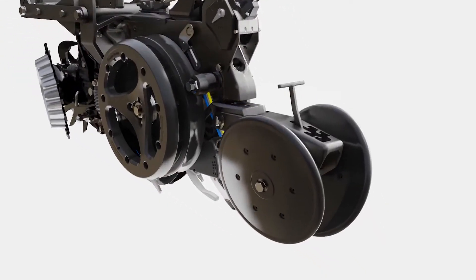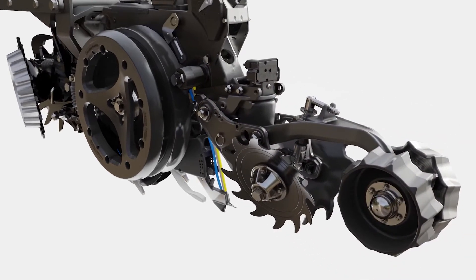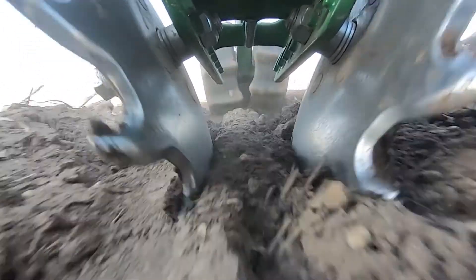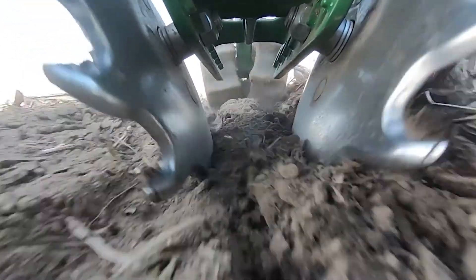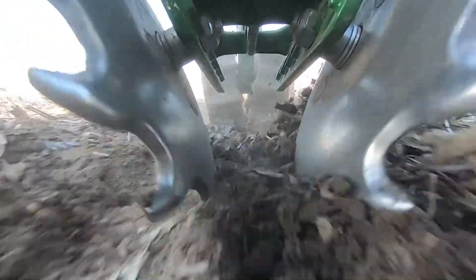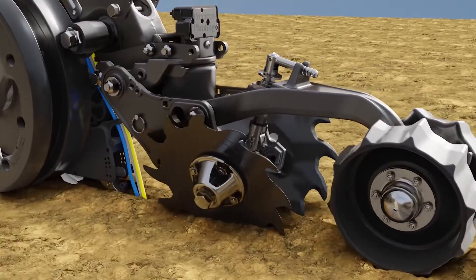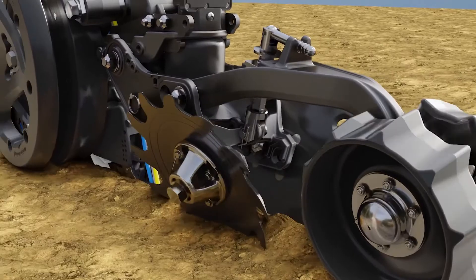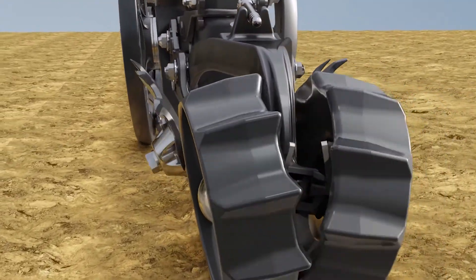Here's a video of how Furrowforce works. The first two blades you'll see in front is the first stage, and what this first stage is designed to do is lift and fracture the sidewalls. The sidewalls are from the openers that came in and made that true V. We plant the seed in the bottom of the true V, and this first stage is designed to lift and fracture those sidewalls, blow them out, make it look like we were never ever there.